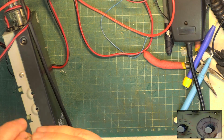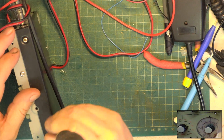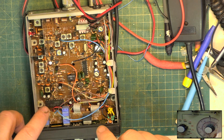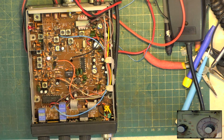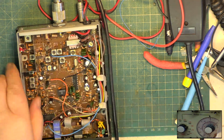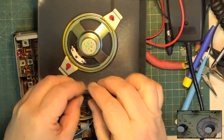There's a little tip on this that when it was first here and there was no transmit or receive, bearing in mind the VCO was also out of lock because it had been twiddled, there was no whine coming from the synthesizer. Once I'd removed that hygroscopic pad, and I just went through the soldering just in case underneath, I then, even though the VCO was out of lock, I could hear this high-pitched whine from the synthesizer. So that was what was totally different. And you then felt, yeah, that's working. And it was.